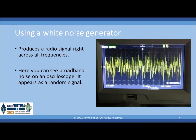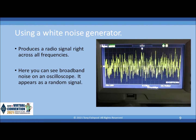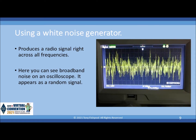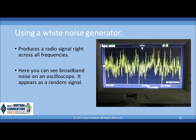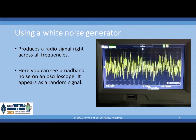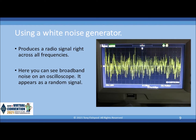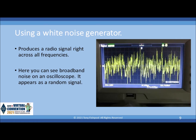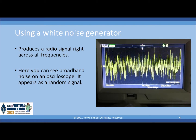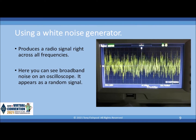The oscilloscope is a device that displays voltage against time, and is therefore said to display signals in the time domain. Aside from things like multimeters, when you can afford it, an oscilloscope is so very useful. Being able to apply the test leads to a circuit and see a visual representation of what is happening is very revealing. It's best to avoid the gimmick 15 quid oscilloscope kits from China. They won't show you much of what's happening at radio frequencies.